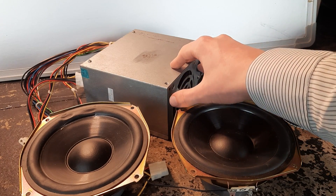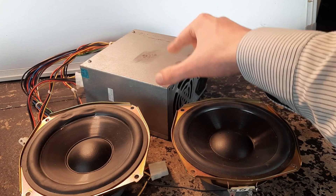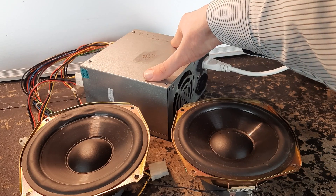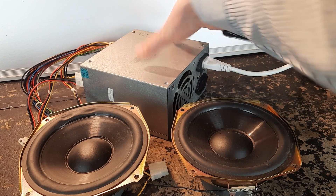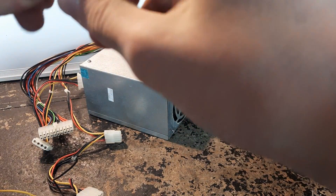Not because it's terrible, but probably because it's old and worn out - you saw the condition inside. There are leaky capacitors inside; maybe those are taking some of the current because they're shorted or something. I'm going to see what happens if I bridge two power rails together - the 5 volt and 12 volt power rails.